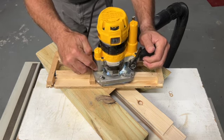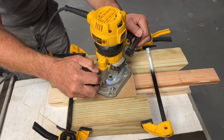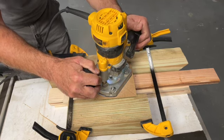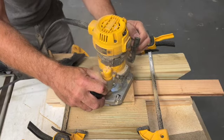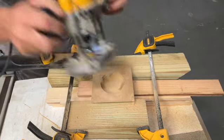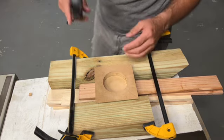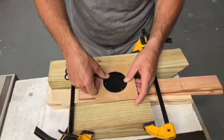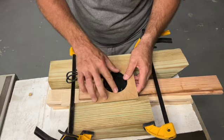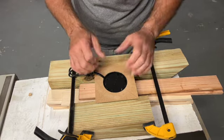Then we'll remove the jig, set the depth for the thickness of the light, and finish the hole directly on to the top piece. I'm going to check the depth of the hole by putting in the piece upside down. It may be a bit of a struggle to get it in and out, but the little wedges are just touching — which means it's perfect.